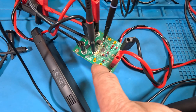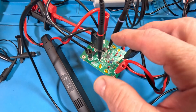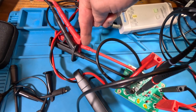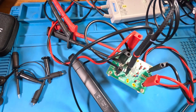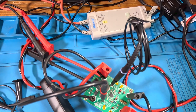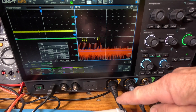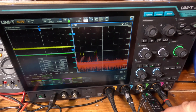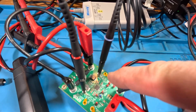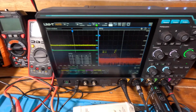I've done other videos talking about this — particularly the one on probing EMI noise rail where I explain buck converter operation on the whiteboard. Here we have differential probes coming in. I also have a current probe, but it gives similar results to the differential probe, so I'm using differential. Channel one is the differential input we'll be looking at, channel three is the current probe, and channels two and four are the switching nodes.